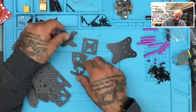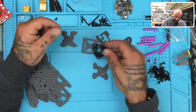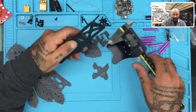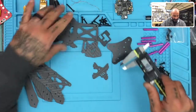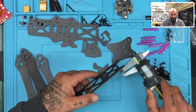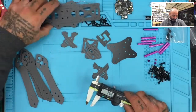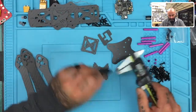Alright, then we've got a couple other things here — camera, camera. I'm going to have to see where all this stuff would go. So let's just start taking a measurement here. Let's get our calipers out and zero that out. About two millimeters — that says 191, so it's going to be less than two millimeters. And again here, this is one and a half millimeters. So you've got your bottom plate at two or a little under, and your top plate at about one and a half. Camera side plate is probably one and a half as well.